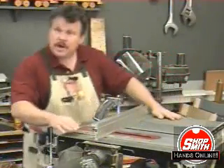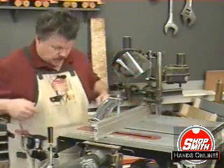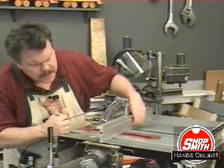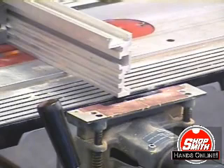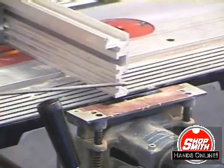To do this, you need to set up your biscuit joiner so it's horizontal - it's not on the mark five but actually laid down. We're going to use the miter gauge and this auxiliary fence to guide our work. The first thing we do to set this up is adjust the end of the fence so that it's even with the middle of the blade of the biscuit cutter. That way we can use the end of the fence as an indicator for where to position our board.